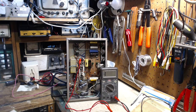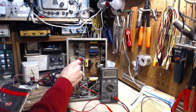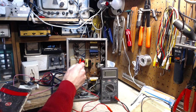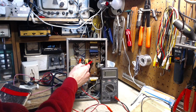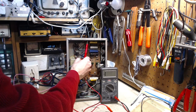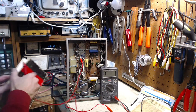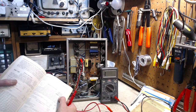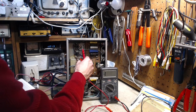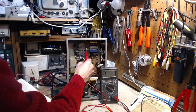In any case, I've identified the two plates: two and five. And then by connecting up my meter to pin two, I can then find out where the wire runs. That's this blue wire. I've done this already, so I'll just show you. Okay, let's go and look at the other plate. So this is pin five — that's the other plate.